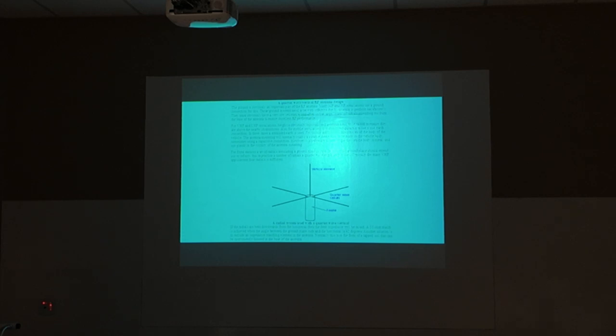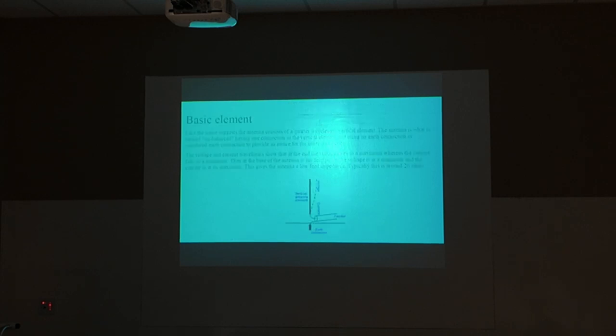So that has nothing to do with radials, because you don't know what the velocity factor is of whatever wire you're going to put out for radials. All we need to realize is that if this is a coax, and that's the center conductor, so that's your positive, and the shield, the radials are on the shield, then that's going to match. That's going to make this antenna look like this.